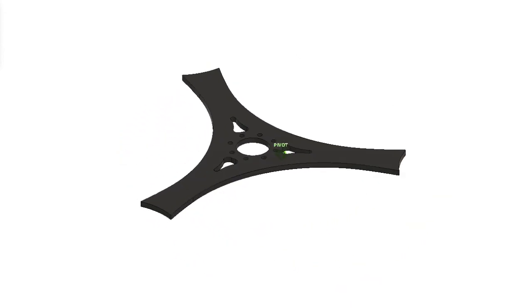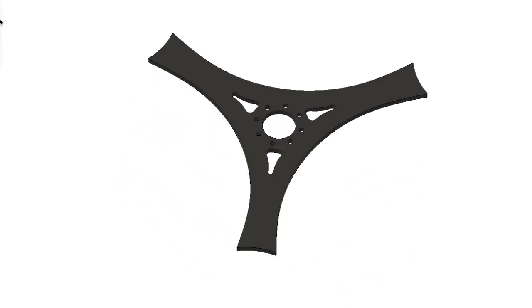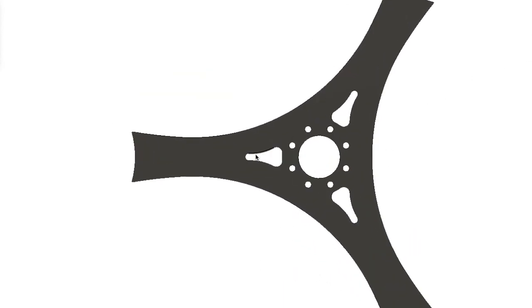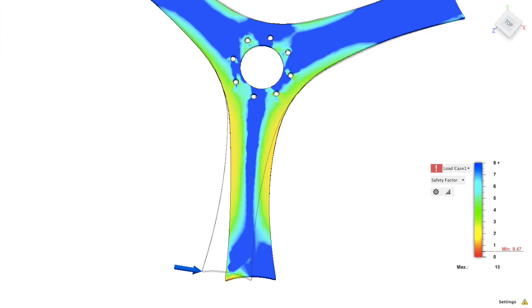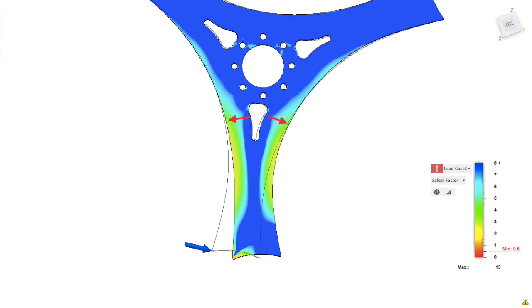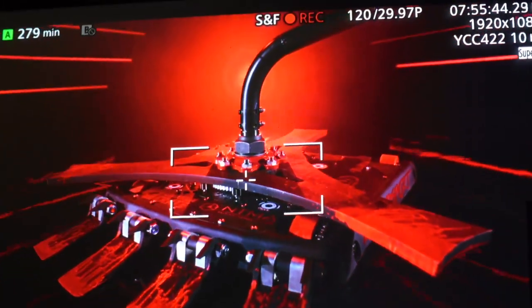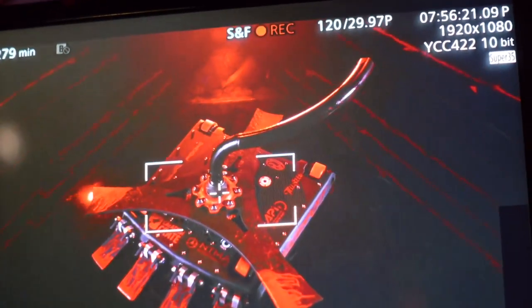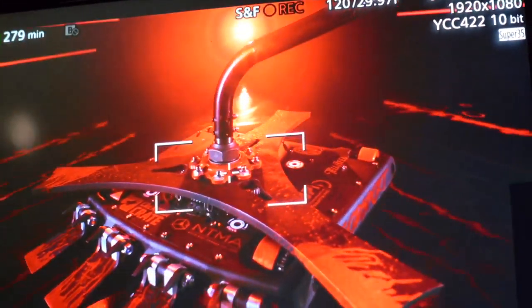Of course, we can also try to minimize the bending by changing the design. To make tri-again stronger, we put a bunch of holes in the middle. What this does is take the material from the middle of the base of each arm, where there's almost no stress during a hit, and move it out to widen the base of the arm and strengthen everything in that area. The arms are also a bit shorter, with the new tri-bar being only 42 inches in diameter instead of 46. These two changes make the bending stresses a lot lower, and make tri-again a lot stronger at the point where the old tri-bar broke.